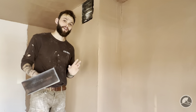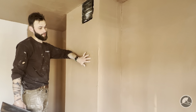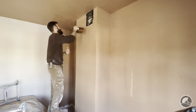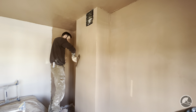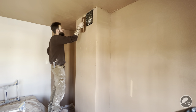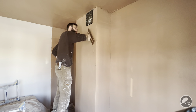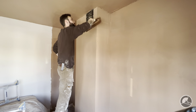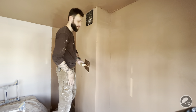We're now at the point where we're going to flatten what we've put on. If I run my fingers over the wall you can see it's not digging in but it still has a slimy texture - that tells me I can flatten most of this in without leaving too many tram lines. Starting from the top with lots of pressure and a relatively shallow angle, just push down the bead, make sure it's nice and filled in, and pull up to really start closing that plaster in. This is obviously a lot easier with a speed skim or spatula because you can do it much earlier, but if you haven't got one, you just have to wait a little bit before you can flatten it.